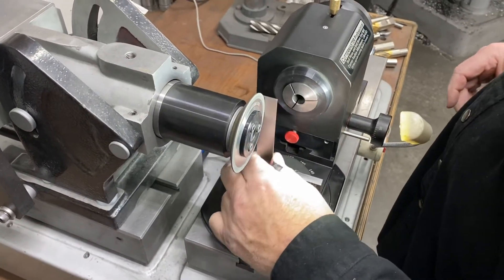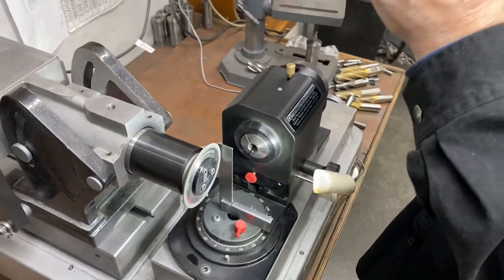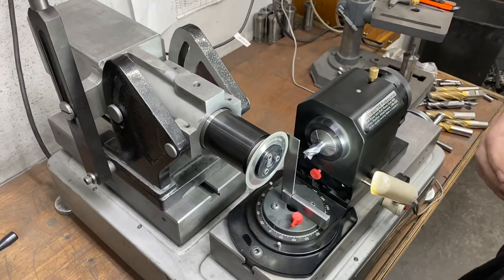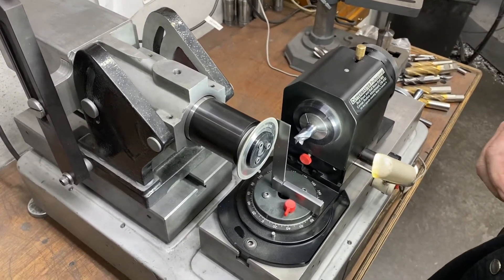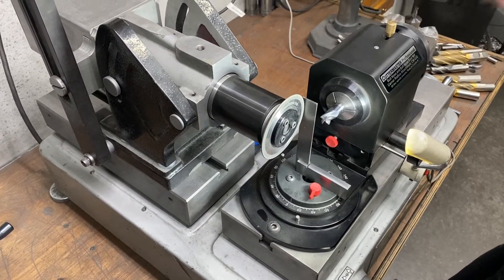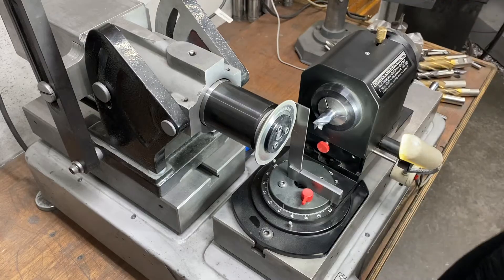What we're going to do is grind the end of this end mill. It's a standard end mill — it's not a variable pitch. For those of you that are familiar with this, you'll know that on a Cuttermaster or any hand machine, picking up the grind is difficult. So we're kind of showing off by being able to do that. We will grind one from a cutoff in another video, but you'll get the idea.